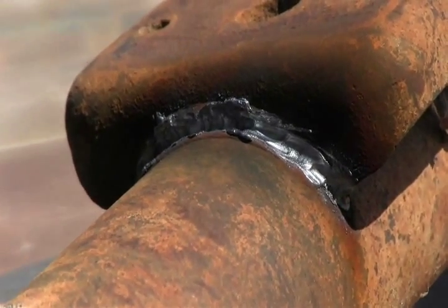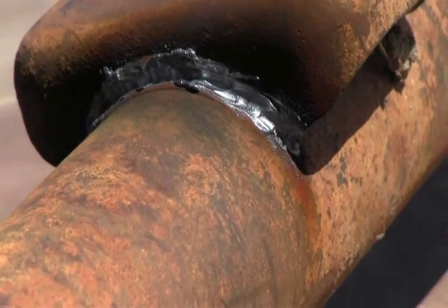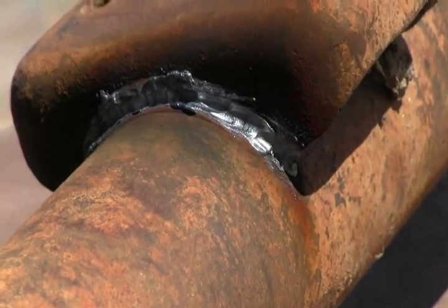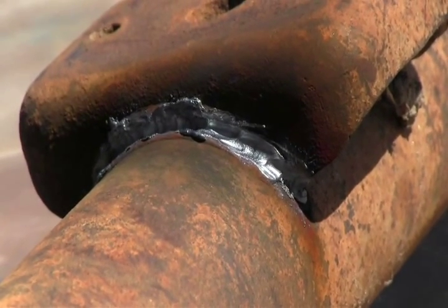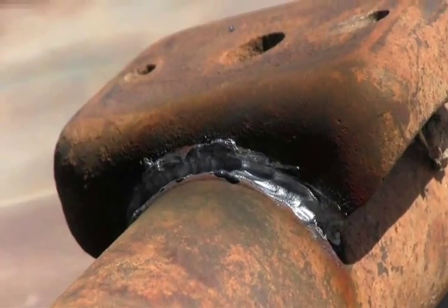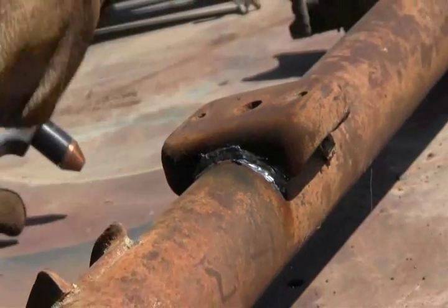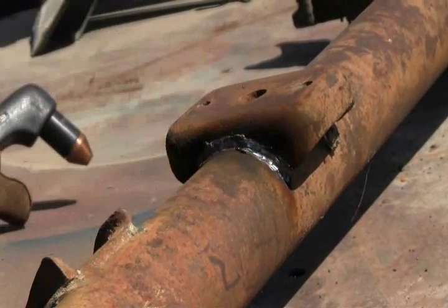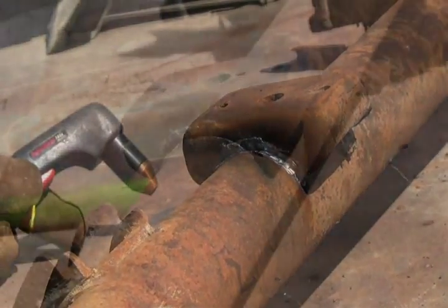For any of you that have done this kind of work, it's a lot harder to do with a grinding wheel or other means than it is with gouging with the Powermax 45 Plasma. You can see how easy that is. Try not to cut into the housing — in this case we might save this piece, as Mike may use it for something else. The objective is to just clean out the weld, wash out the weld — another term is scarfing. So we're trying to scarf the weld out.